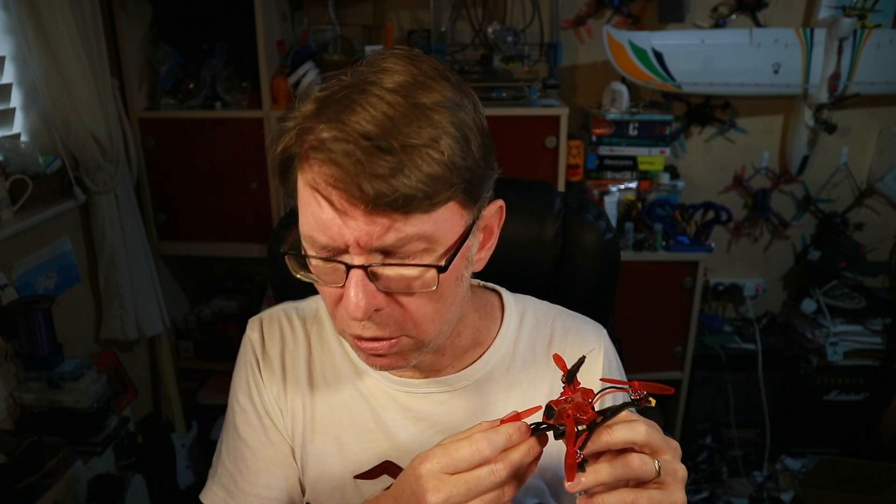This thing is doing just amazing — it's like magic. I've got this fitted inside a tiny little model and it can outfly every range I've got based on battery running out. Aside from the battery, it's magical — a tiny receiver stuffed in there that can go as far as this model can ever take it. This is not the thing you'd put in your big model for long range because it hasn't got a nice antenna, but for your whoops and toothpicks where SPI receivers were really letting you down, these are just black magic. Full signal anywhere — you can completely outfly your video signal, which is what you want. And I already know there are flight controllers coming out with built-in ELRS receivers — that's going to be a game changer.